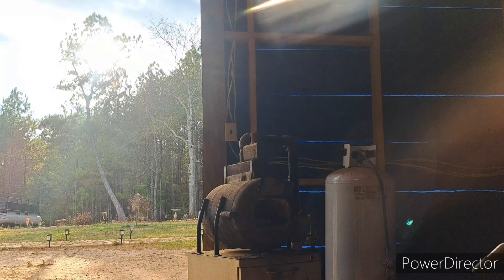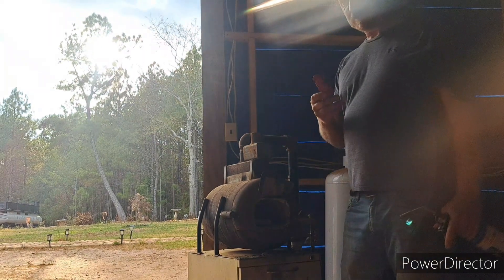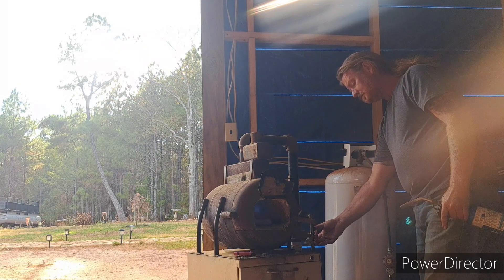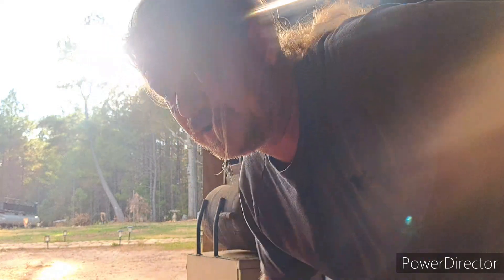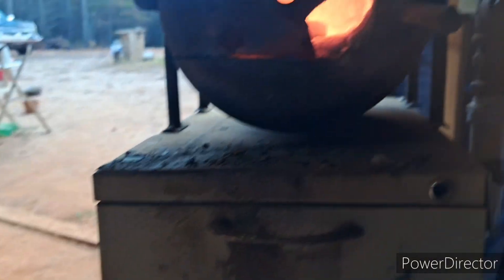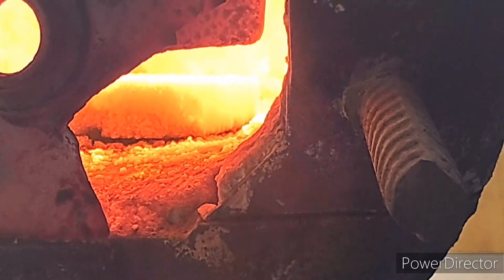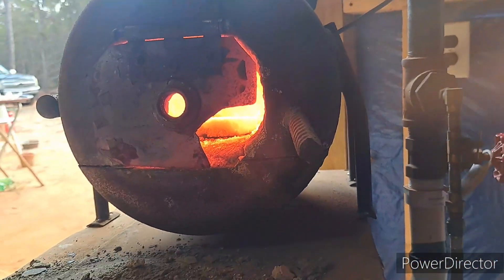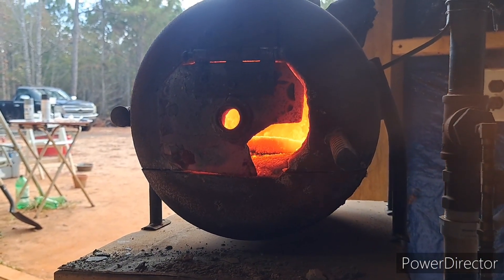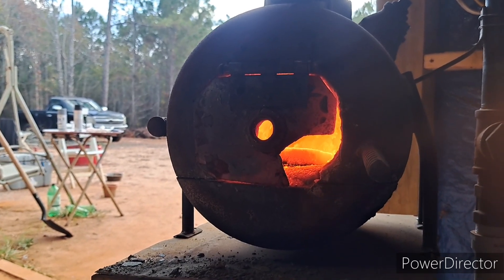Alright, so I got it in there. We're going to crank this up. I need to be safe — put that down, I wouldn't want to fall on that. Now we're just going to give this... I don't know, I melted all that other crap in about an hour. Give it an hour, but not running so hot. It's got a red heat right now — it looks brighter than that but it's not. It's got a red heat. So I'm going to let that go for another 30 minutes, shut it down, let it cool all the way off. And then I'm going to really pump the heat to it, get it like yellow, then shut it off and let it cool down and see what we got.